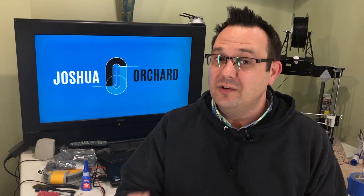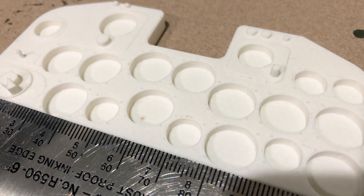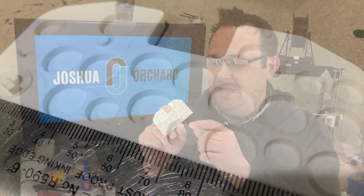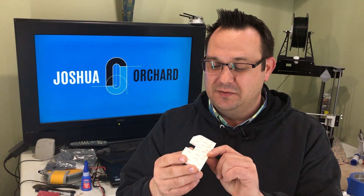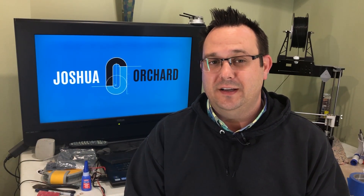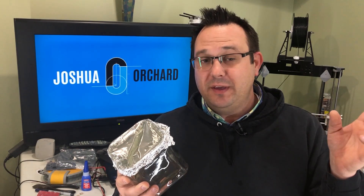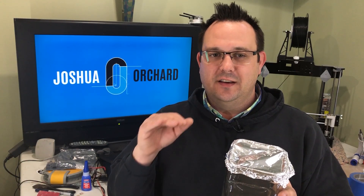The main purpose of switching to that nozzle was to print the front instrument panel, which I designed months and months ago. It has little screw heads and all of those details are picked out perfectly in this print — this is the very first print I tried and it worked marvellously. Some of these parts I now need to process in an acetone vapor bath, which slightly melts the ABS prints and smooths them out so they don't look so much like 3D prints.